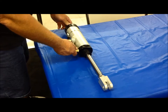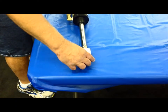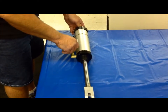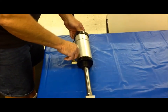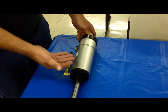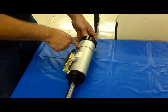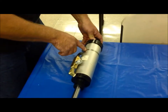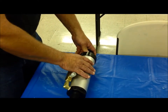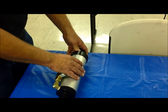Okay, what we're looking at here is our top wheel cylinder. The main parts of the top wheel cylinder are the clevis at the right end of the cylinder, which engages the linkage. You have your flow control. In this case, what we're doing is we're controlling air, not air over oil. We're controlling air to slow the upward motion of the top wheel. And then depending on the age of your Freestyler, you may have a reed switch, which indicates that the top wheel is all the way up, mounted on the cylinder. Or on newer model Freestylers, you'll actually have a proximity sensor mounted externally from the passenger side pod, reading that the top wheel is up.